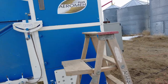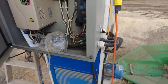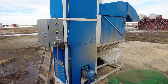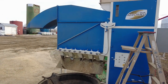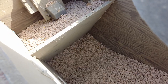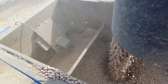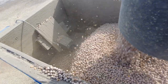It only has two motors: a vibratory conveyor in the middle and a fan at the bottom. Those two motors are controlled by VFDs inside, because they're three-phase motors, so we can change the RPMs very easily. It's a very simple machine to run — very few controls, no screens to change, very few moving parts, so it's going to take a very long time to wear out. We spent about $13,000 on this machine; I think they're about $16,000 to buy now. I put a switch up in the top hopper to turn the auger on, and when the hopper gets full it also turns the auger off, so the machine always has grain sitting on top of it but I don't have to babysit it. It still means the machine can be portable because it doesn't have a bin on top.